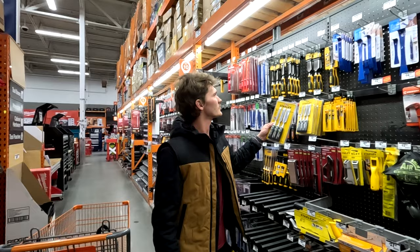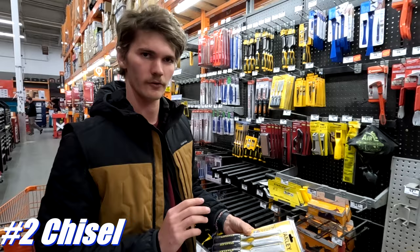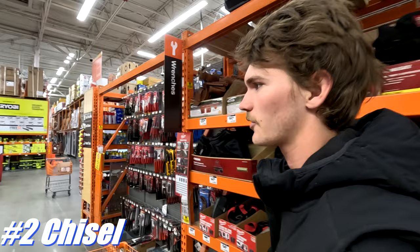The next tool is a chisel. You could get a big chisel for $18, but I always got the multi-packs — you really only want the one-inch chisel anyway; just throw the others in a toolbox. At least a one-inch, or a one-and-a-half is even better. Chisels are something I actually don't mind going cheap on, because as a framer you're going to hit nails, hit concrete — you'll dull it up anyway. We call them beater chisels, and there's a reason for that.